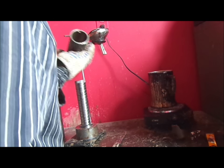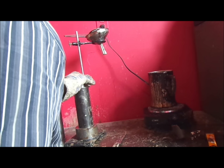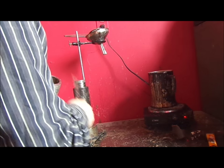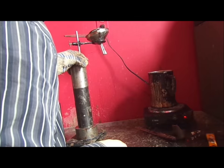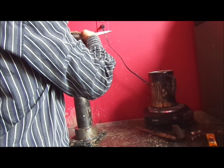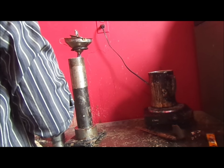Put the outer tube on. This only goes on one direction. Other side will not fit on our washer on there. So we've lubricated both parts, and then we add what's called the reservoir. This is so that a head of wax goes on and creates a bubble-free blank. Not seen bubbles in the blanks for a long time, so that we also run it through two filters into the wax. It's got two screens.